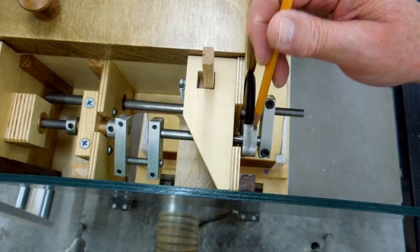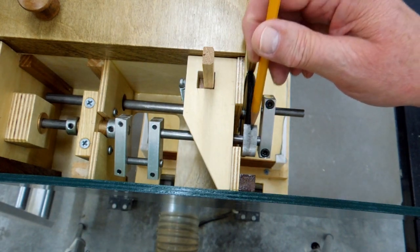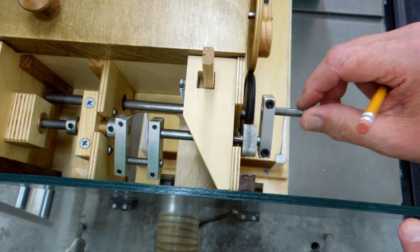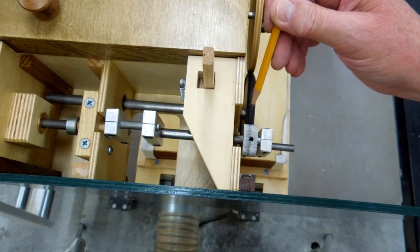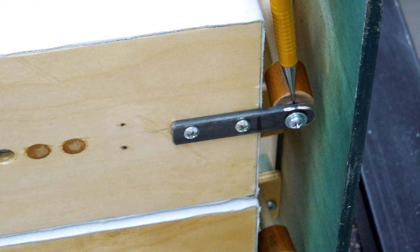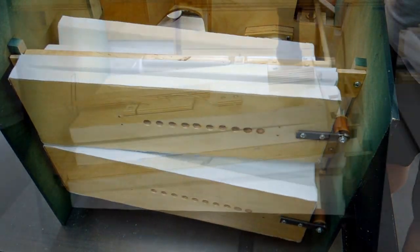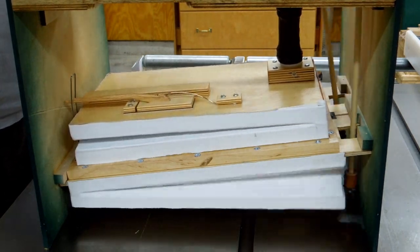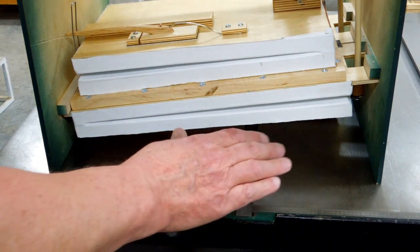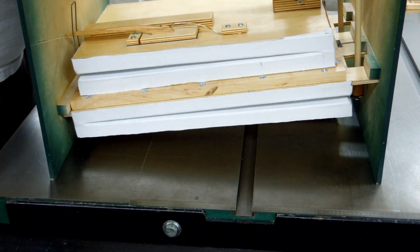If you make your friction collar out of rolled-up paper and sandpaper like shown in the plans, or if you take an aluminum wheel and knurl it, I find this is very solid — that's another one of Jay's gadgets that makes life easier. You want the hoover belt to run right in the center of that. When I installed this screw I put a washer on each side of the grommet to support it, ran that up inside the dowel, and just barely compressed that rubber grommet — I don't want to tighten it too tight, as that allows it to flex at that point. When you start working with this, make sure the top of your bench or table saw is clean so you don't suck anything up inside those bellows — there's quite a bit of air velocity going in and out of those holes.